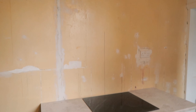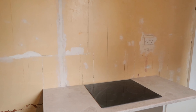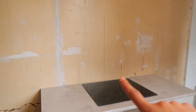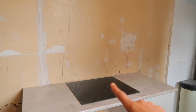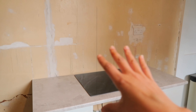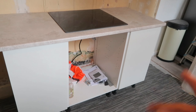I was thinking that I could get away with just painting this wall, but after going around and taking out all the wall plugs and stuff the wall started crumbling, so I'm going to go back to the original plan of putting lining paper up and painting it. I'm going to be doing a tiled splashback on the back of here, so I don't want paper all the way over the wall because I don't think the tiles will stick to the wallpaper. I'm just going to mark out roughly whereabouts the splashback is going to be and paper around that so that the tiles can stick to the wall.